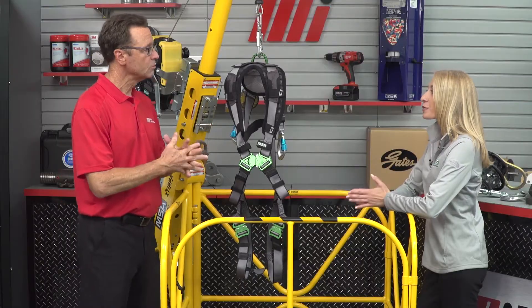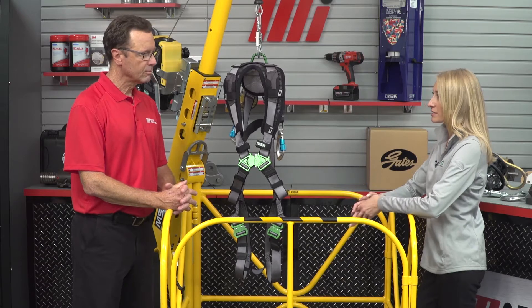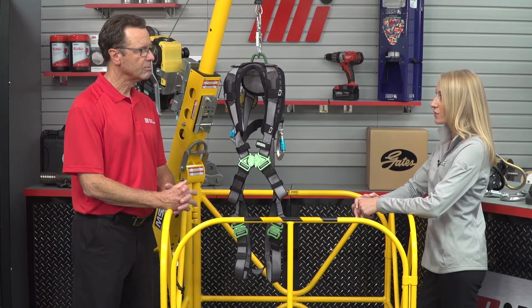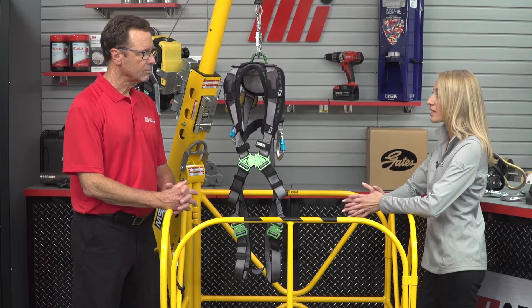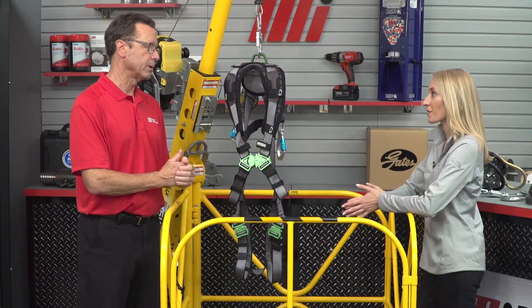So let's start with why. OSHA has set rules and regulations mandating the proper use of fall protection. There are three main components to the personal fall arrest system and they must be in place and properly used for maximum protection against falls. So A stands for Anchorage Points — a secure location of attachment such as an I-beam or rebar to which a worker may safely connect their fall arrest system.